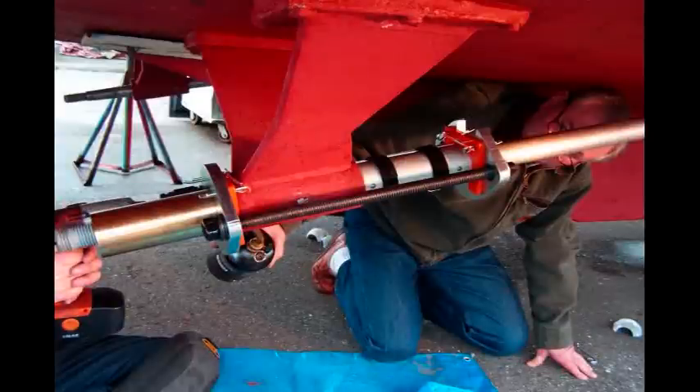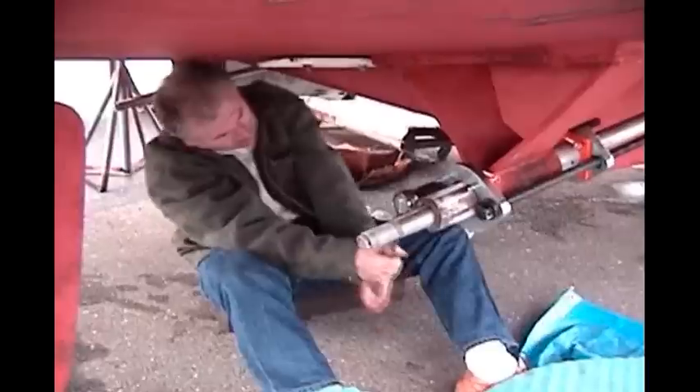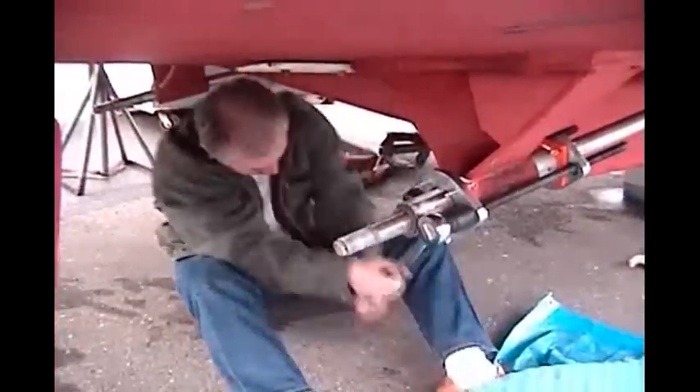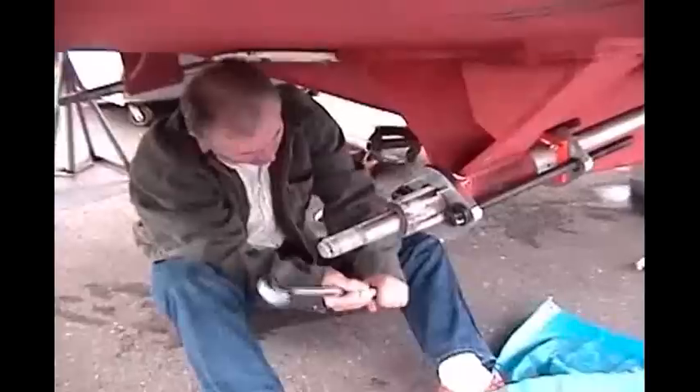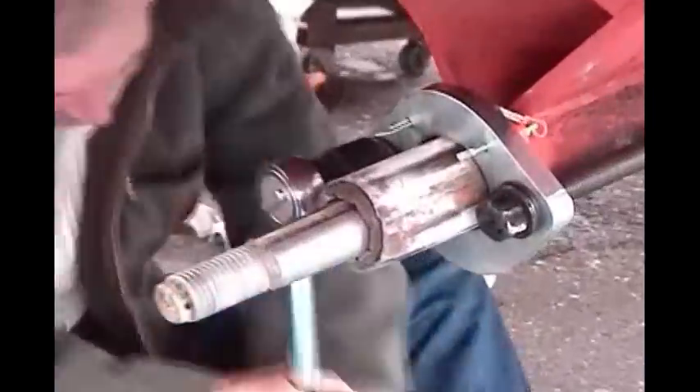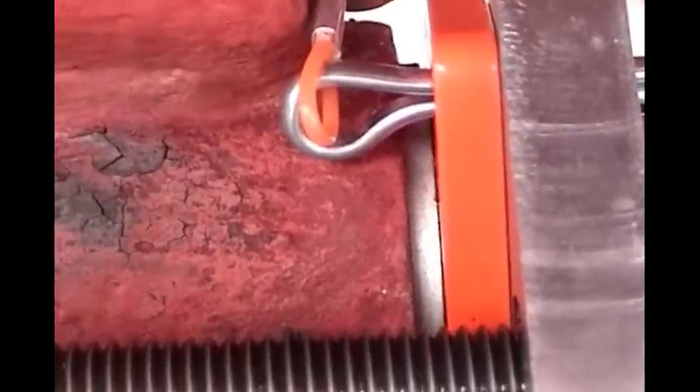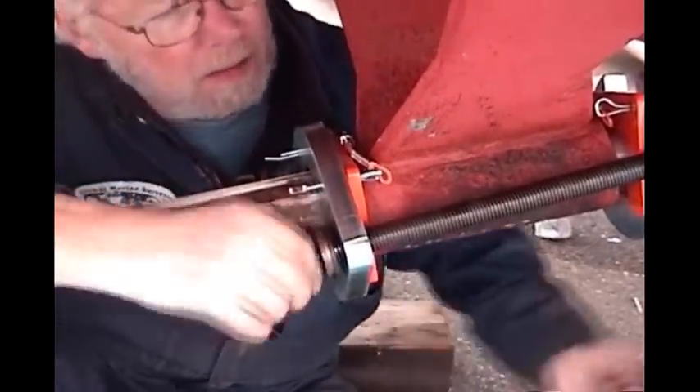Watch carefully. If the puller assembly gets tight without the bearing moving, stop and examine the cause. Also, re-examine to make positive there are no set screws securing the bearing into the strut. Proceed with caution — turn each nut no more than five cranks, then the other. Watch closely to ensure alignment remains consistent between the forward and aft yokes. As you continue turning the nuts, the tool will force the collets into the forward end of the strut, forcing the worn bearing out the aft. Once the bearing is free, it can easily be slid back and off of the propeller shaft.